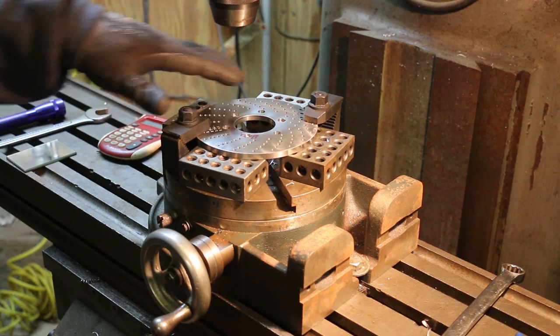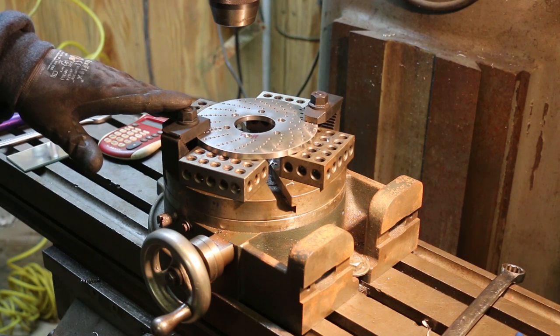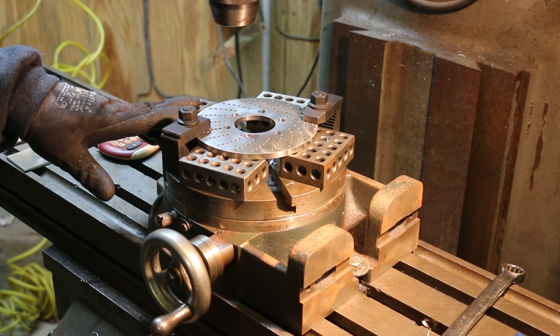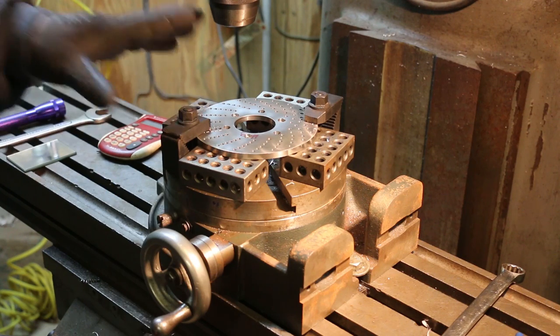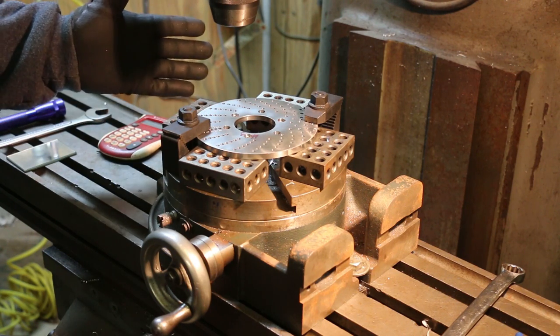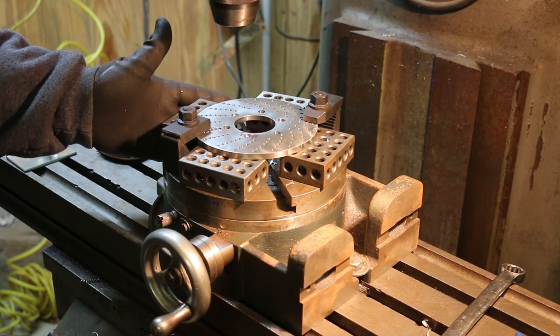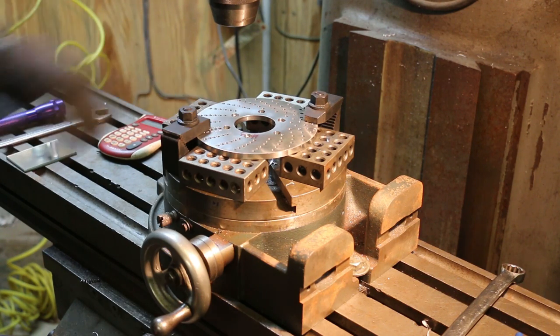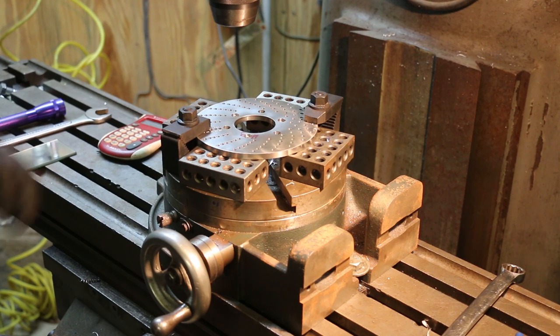When I did this before many years ago, I actually had a list of every angle I would dial to, and I'd check it, double check, and actually had someone else check it behind me — because you just couldn't be off. Anyway, that's one way of putting a hole pattern in. The drilling part here went fairly quickly. Truth of the matter is, the setup took a really long time. You guys just saw a few seconds of it, but I probably spent over an hour getting the rotary table centered and then getting the disc centered on there. For a one-off job, this is very tedious and time-consuming.